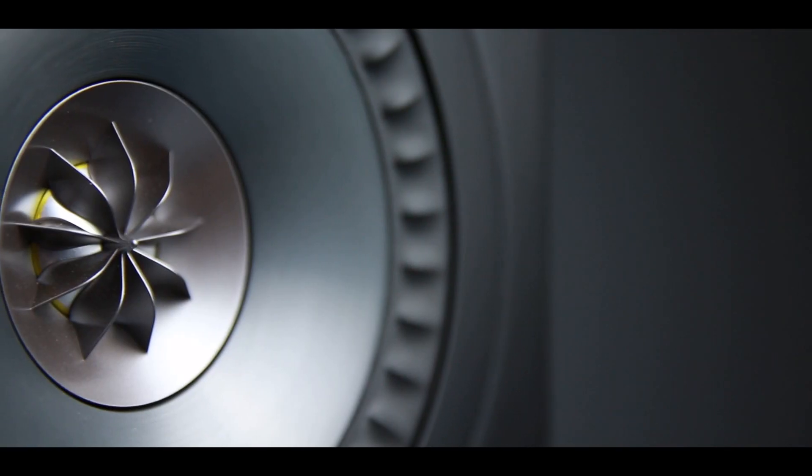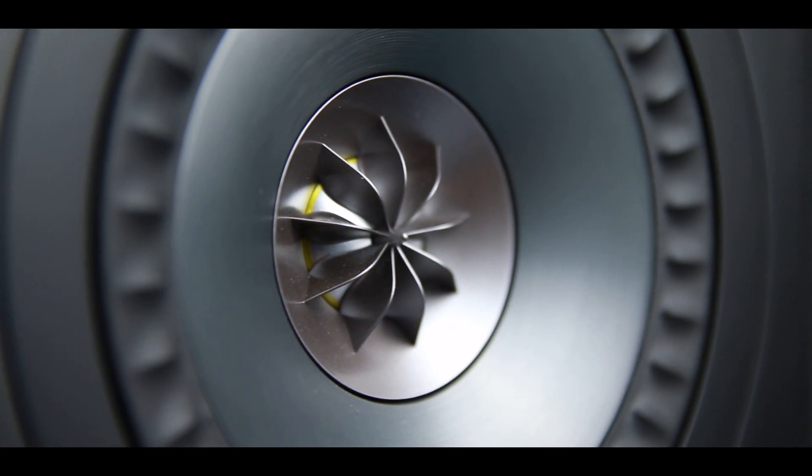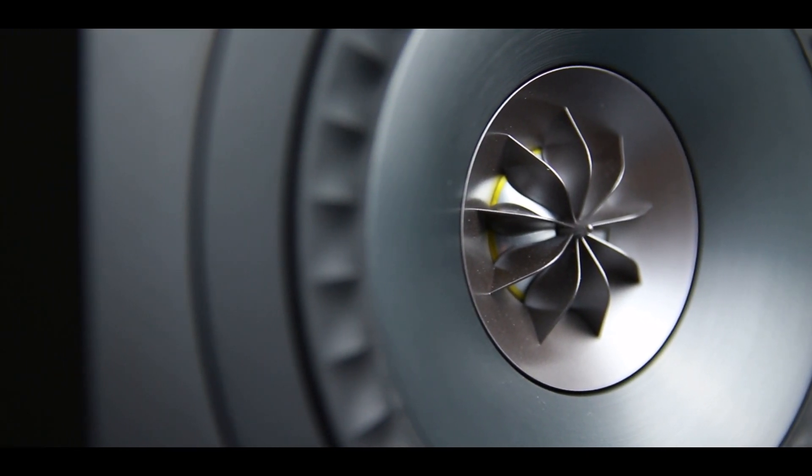The bass is clean, clear, and tight, but it just lacks real low end. Pretty much anything below about 90 to 100 Hz is almost non-existent and drops off drastically. This is because of the coaxial design — the area in the middle is cut out, so it isn't producing the same low frequencies as the rest of the woofer's donut shape. Bass starts kicking hard around 100 Hz but everything below falls off. If you want a full-range experience, I'd highly recommend adding a subwoofer.